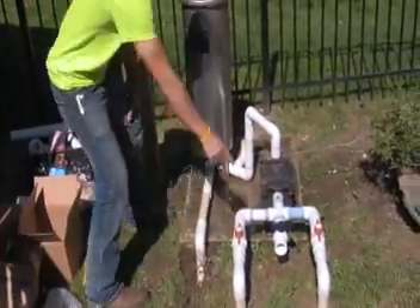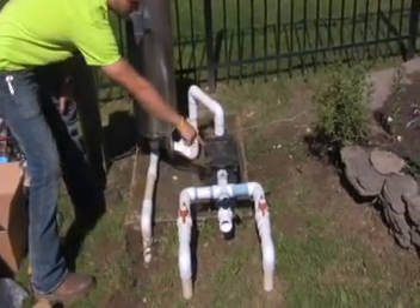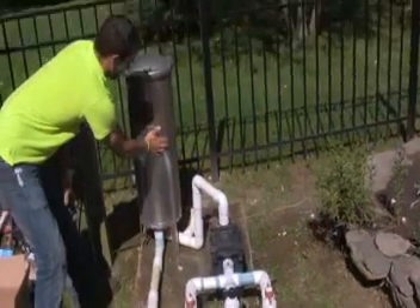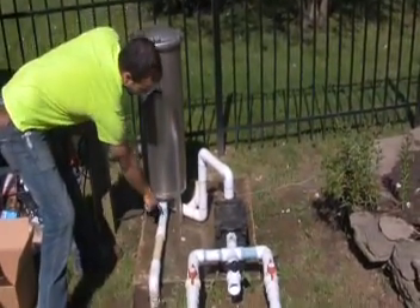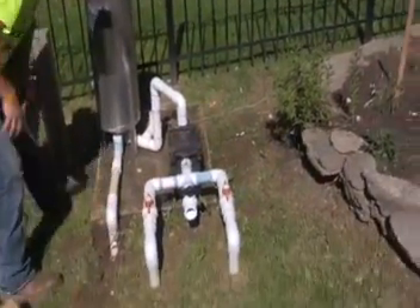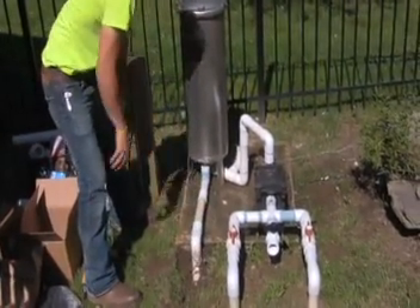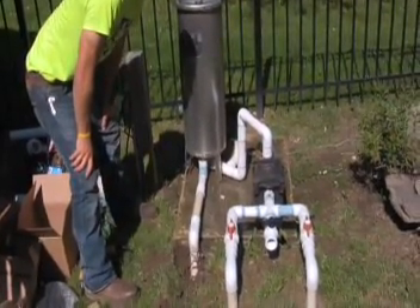Here's the pump — the water from the pool comes up through here, goes through the pump, gets pumped through here and up into the filter. The filter then relieves the water here and it goes back into the pool. What we're going to do is cut the line here and here and install our system right here, so everything is after the filter.